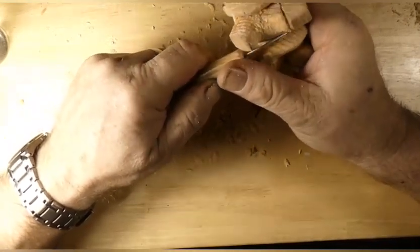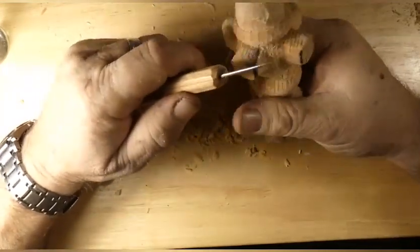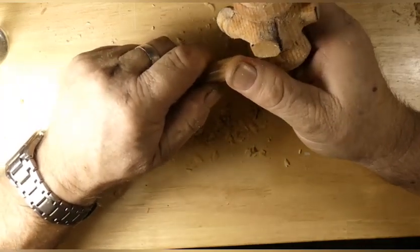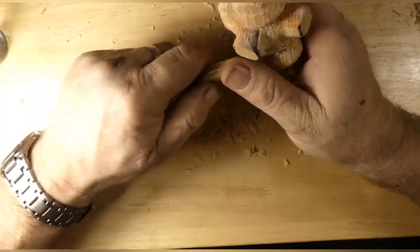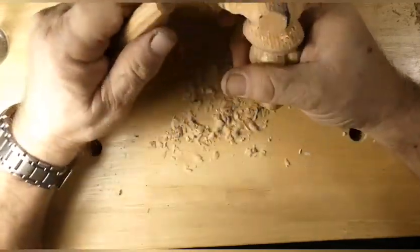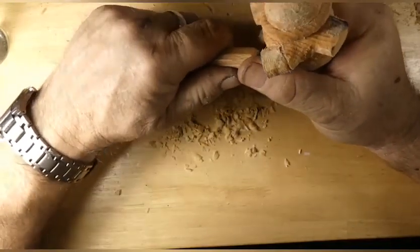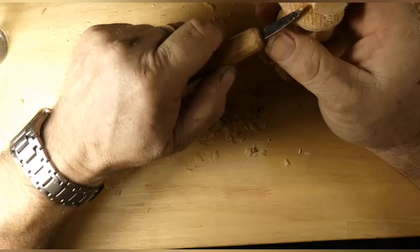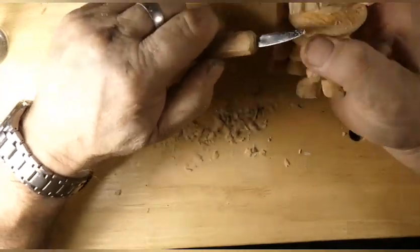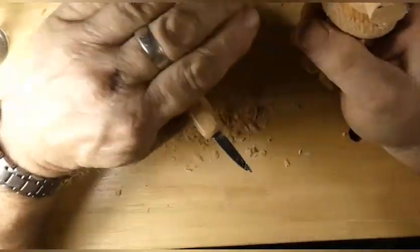And with a knife, you can actually feel it skip. You can hear it skip. Most of the time with a Dremel you don't have that problem, but I have with a Dremel on occasion, with different types of pine, had an issue, especially with diamond burrs, where you'll be trying to smooth this out, and wherever that whitewood is, it'll just dive right in there, and then it hits that harder wood, so it wants to jump over it, so then you end up with a wavy surface.